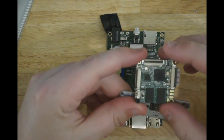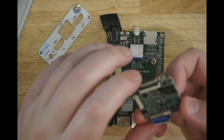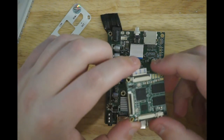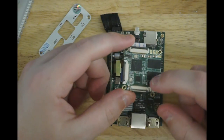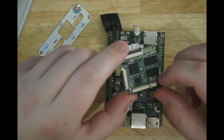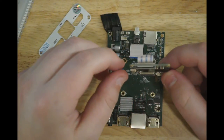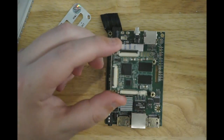So these ones are the inputs and this is the output of your video feeds. That's a neat little box - I'm sure it could do more. There are signs they had some expansion capabilities, like the fact that it had a second input potentially, and this nice little ribbon cable clamp on the underside that isn't used by anything on the board. Maybe it was a firmware update connection. They still have this nice little two-pin here which makes me think maybe they had a two-wire serial connection. They definitely had some test through-holes here that may or may not be wired to stuff.